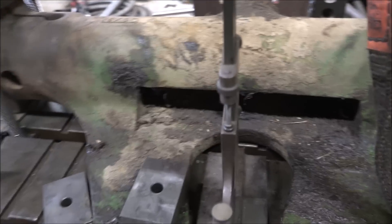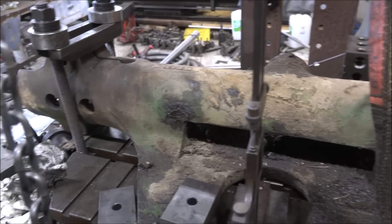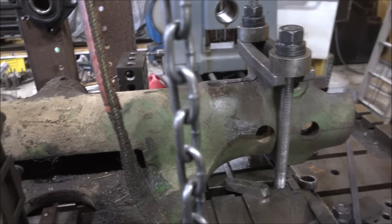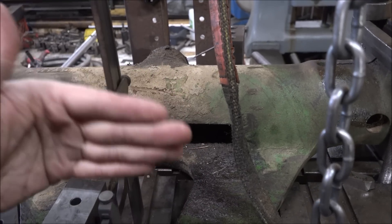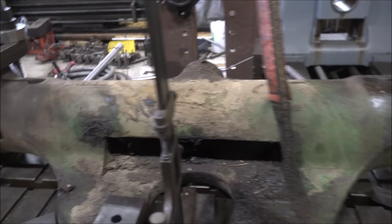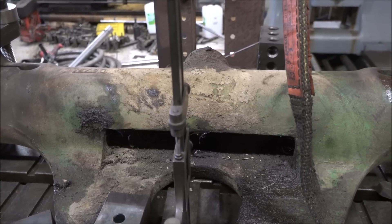As per my standard procedure with the castings, I kind of base things up as close as I can off of the slots on the mill — or in this case, the rotary table. The casting is back against the studs which are in the slots at the same positions on both sides, so that should have this way pretty good, at least within the tolerance of the axle casting thickness. Given that it's a 36-inch distance there, the error here is pretty small. And it's not that important because if a farm tractor is out 20 thousandths on the actual positions, no one's ever going to know — and it's likely as good or better than they had it from the factory in the first place.